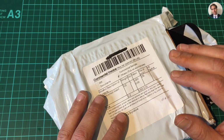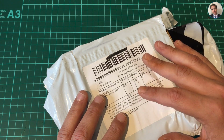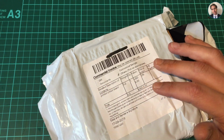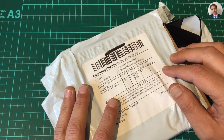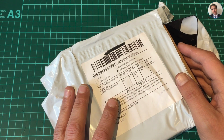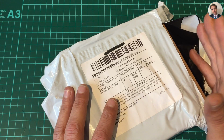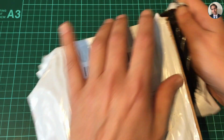Today I'm going to start with the USB socket and some passive components, just to see if it all works and I've gotten the correct footprints, because that's a bit of a challenge. I'm using EasyEDA to design my boards, and then I go on AliExpress and try to find the components which have the same footprint as the footprint in EasyEDA. I'm not using LCSC. Yes, LCSC. Just because, you know, usually you can find things on AliExpress a lot cheaper. But quit stalling and show the board.